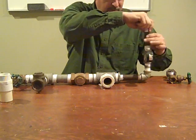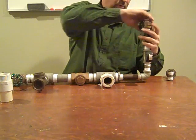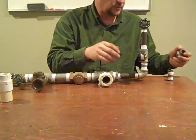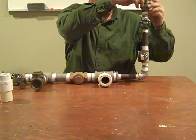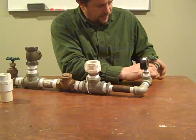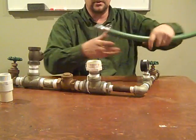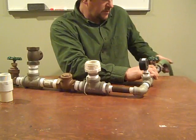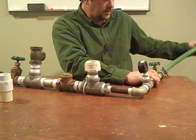Then I put an outside valve — this is a very important valve. The outside valve allows me to actually start this ram easier. I'll show you that. The ram stays on its own — very simple. I'm putting a union on the end and then the delivery pipe. I have a piece of PEX here but you can use Schedule 40, and I just have a barb fitting. You can put a garden hose if you want to. Schedule 40, black pipe, PEX, garden hose — it doesn't much matter.